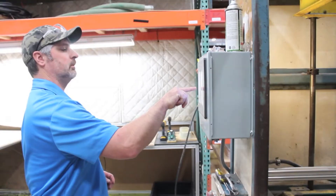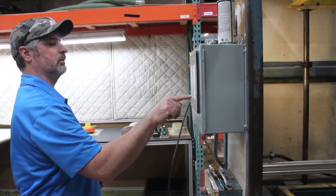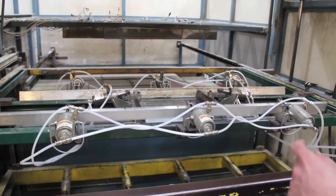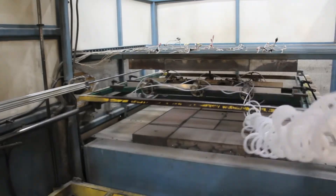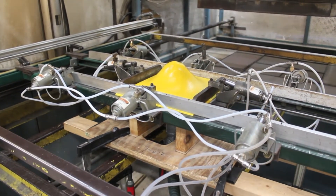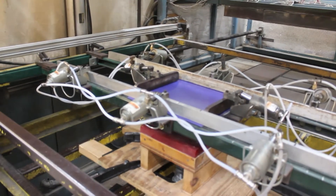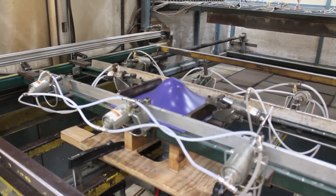My name is Dennis Doily. I am the plant manager of Machine Guard and Cover Company. I have been working here for roughly 15 or 16 years and I know plastic. The blue material, in my opinion, is very similar to normal regular ABS material — it forms the same, and the cool times in or out of the oven are the same. You get some nice crisp shapes of fairly high complexity.